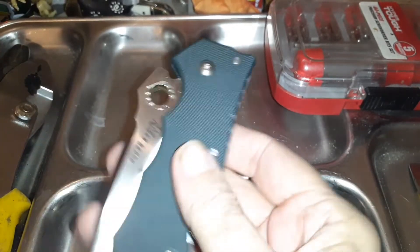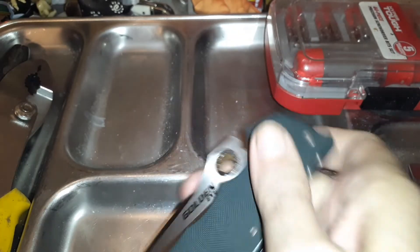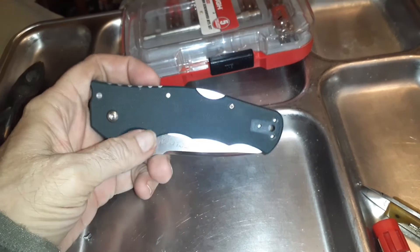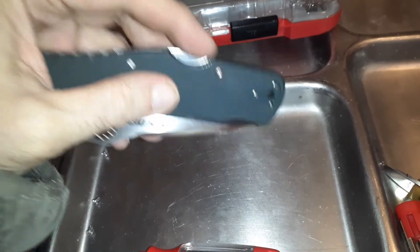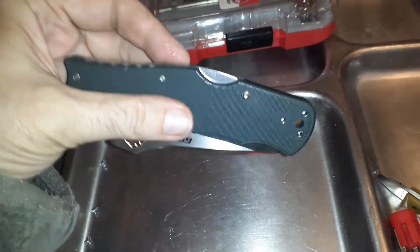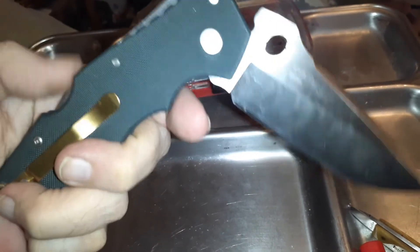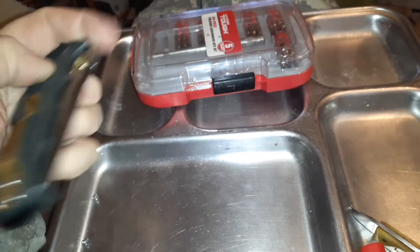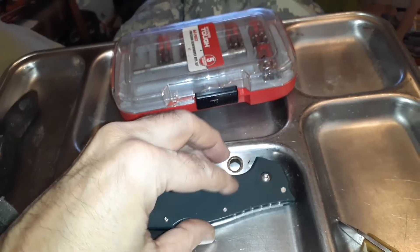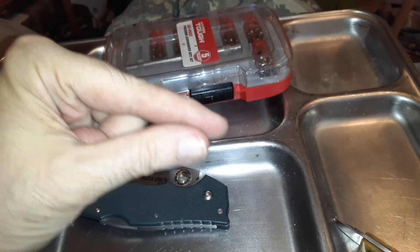I've been carrying this knife — it's nice and slender in my pocket — and now I can fidget with it. Hope you found that useful. One final note: if you get the spring tension too loose, this lock will rattle when you shake the knife. I had it too loose on the original attempt, so I tightened it back up — now it's still easy to disengage and doesn't rattle. It's fairly easy to fix: just bend that bar to whatever tension you want, bend it down slightly.